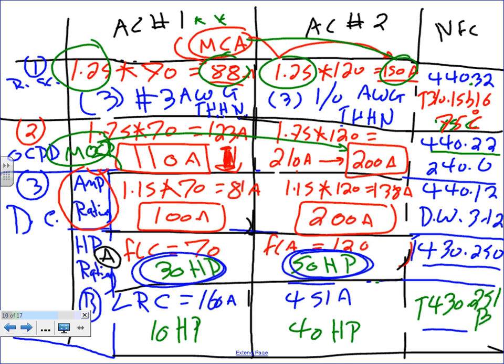They will be on the nameplate. It will say 100 amp, 30 horsepower, right? Stamped on the nameplate. So they rate them with a horsepower and an amp. It could say 100 amp or 30 horsepower or 10 horsepower. We dropped the 10, we got the 30. So we have 100 amp and 30 horsepower. Yeah, these are 'and'. Right. 100 amp and 30 horsepower rated motor versus 100 amp and 10 horsepower rated.